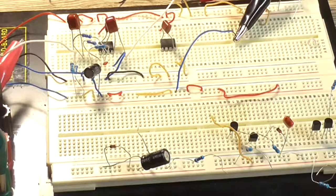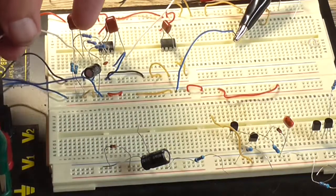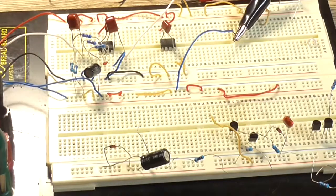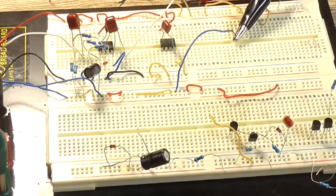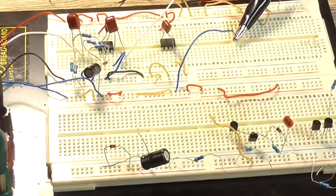Okay, I've got everything set up. I'll just hook the DDS back up to the circuit. I've already tried it. All I've built is the input stage. Now I'm working on the 50 millivolt input range. Unfortunately my DDS doesn't have very good resolution and can't go down that low, and even at 100 millivolt in I am seeing quite a bit of noise on the output. Of course, as you increase the input sensitivity, the clearer the signal gets.